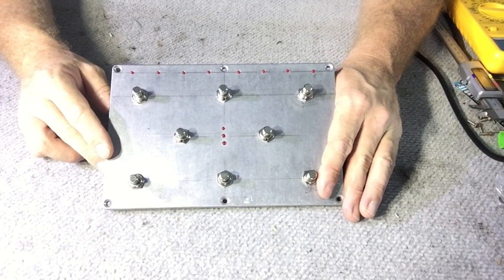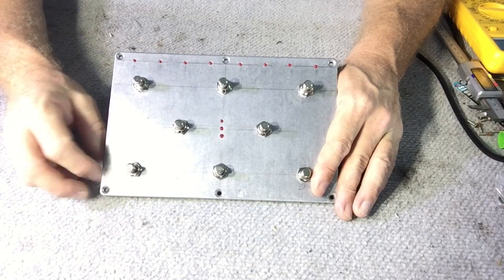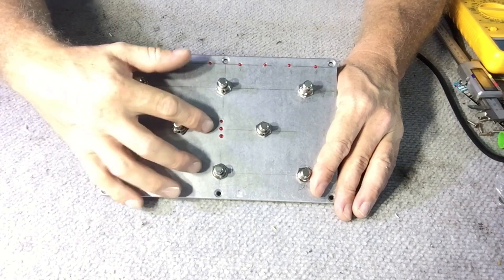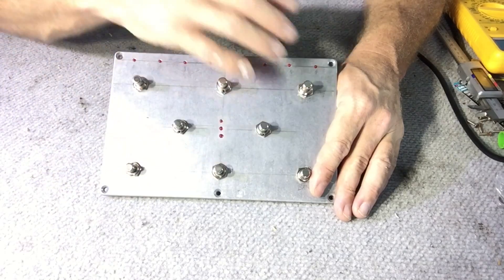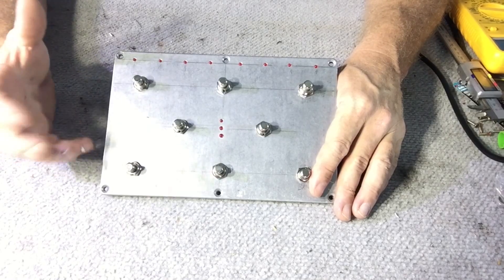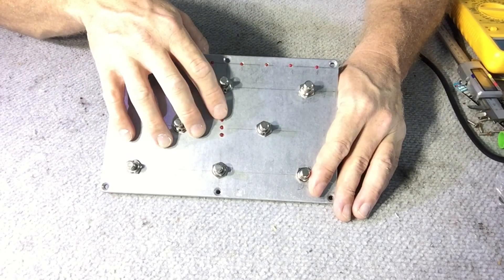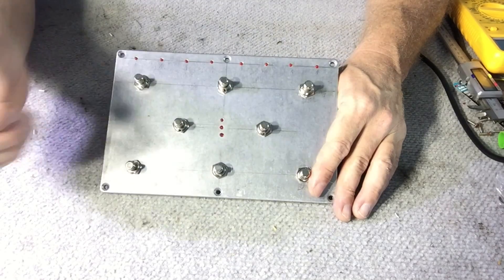Here's the front panel. I've got the 8 switches installed — the 8 momentary foot switches. We've got 8 LEDs to tell us which banks are turned on when we've made a selection. I've got 3 LEDs here to switch between 3 different banks so that each button can do something different on each bank. I've also figured that if I want more options, I can switch to using binary to indicate which bank I'm on, so I can get more than 3 banks.